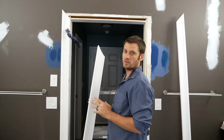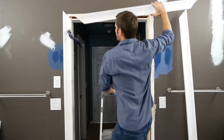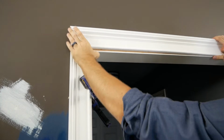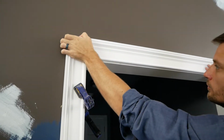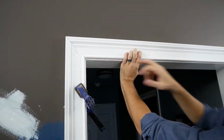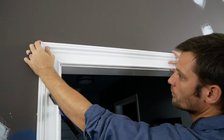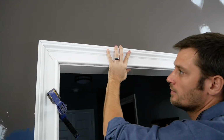From the 45, we can take it back a degree or two until we get exactly where we want it. So if you take a look up here, I'm going to line this up with exactly both my 45s, and we'll see how close we are to what we need. What you can see is, with the two 45s, it's actually coming down a little bit. It starts exactly where we want it here, but it ends a little bit low there. With tolerance, this might work, but in order to bring this back up a little, we're going to want to take some of the top off.